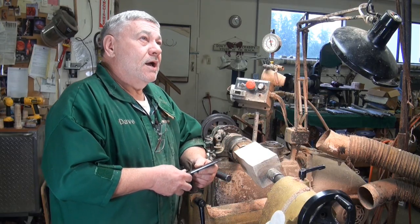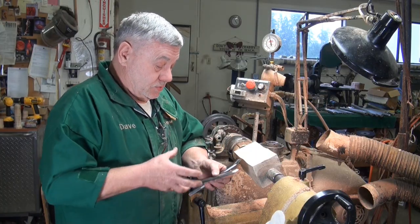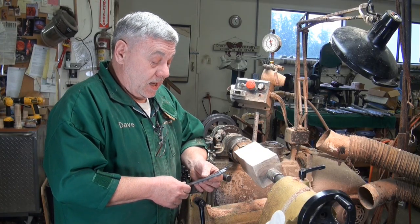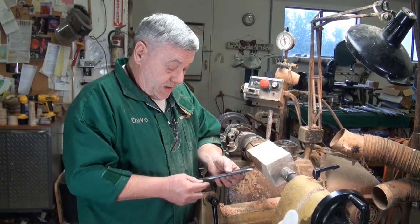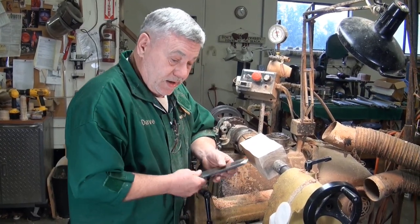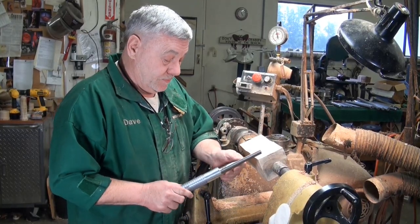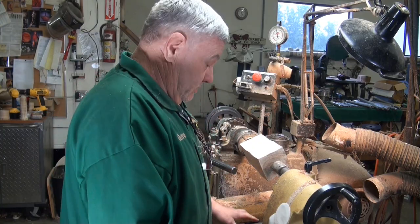You also have to be kind of not real tense when you're turning, because whatever tension you put into a tool is going to wind up right at the business end. If you're hanging on to this tool with a death grip, that's going to show up at the end of the tool. You've got to learn to be comfortable and relaxed. The tools have a tang on the end and are modular — they can go in a handle. The other tool I make for roughing out spindle work is a small roughing gouge, made out of solid bar M42 cobalt, the same steel that fits in my handles.